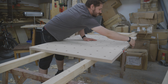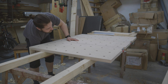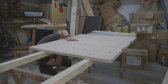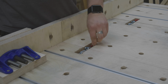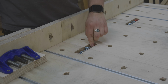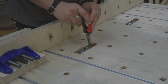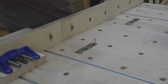The connectors hold the panel well together, but the detachment only works well on the backside. On the bottom side, the connectors are not really accessible, and once they have tension, you can't really open them without using pliers. To fix this, the recesses get some finger grooves on the sides, so that you can grab the connectors properly and pull on the lever.